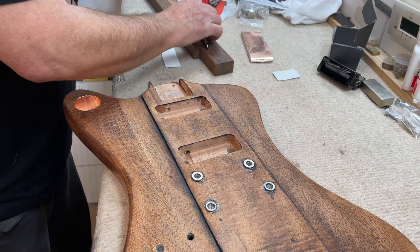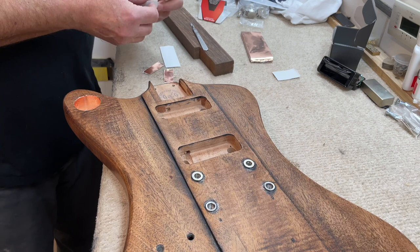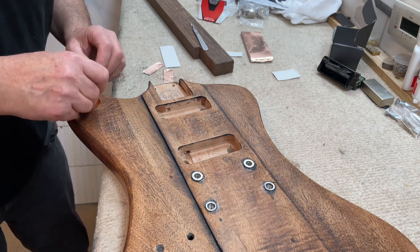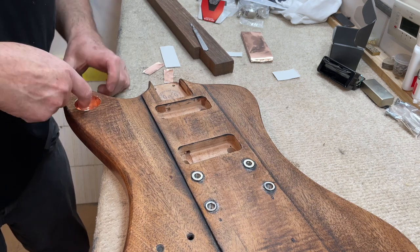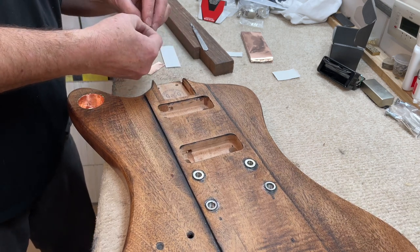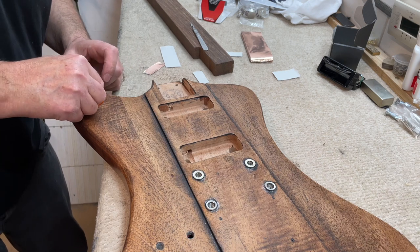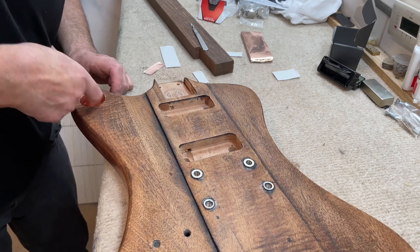So you have to make sure that if you're going to use shield in this way, you have to be confident that your components that shouldn't be touching it don't touch it. Another way to protect against that is to do the shielding, get it grounded, and then you could cover it over. So the shield works as a shield even if it's hidden underneath some, let's say, Gorilla tape or something that you've put in there to keep everything away from everything else. So it doesn't have to be showing in the sort of coppery, shiny business that we've got here.